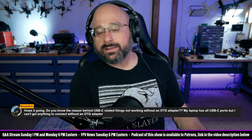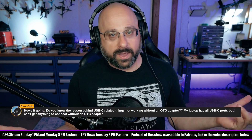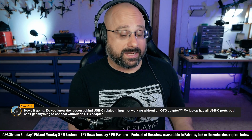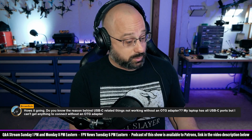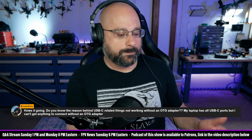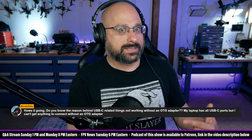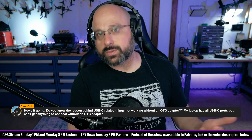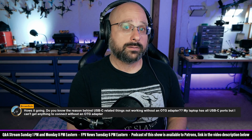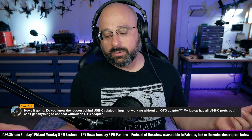What that means is that unlike USB-A, where basically anything you plug in — as long as it can handle 5 volts, you're good to go — with USB-C, if I plug something in and the port goes, 'oh, you want 9 volts? Here's 9 volts,' and then it fries. So with USB-C, it won't work unless the device at the other end tells it, 'hey, here's what I am and here's what I can do.' And the flight controllers that we have often do not do that.